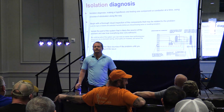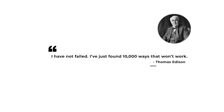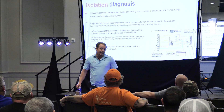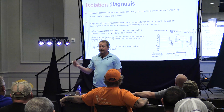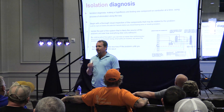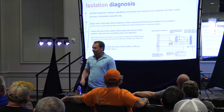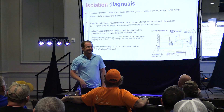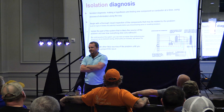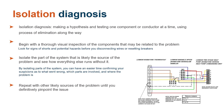The most over-quoted Thomas Edison quote: when he tried a thousand ways to make a light bulb and they said you failed a thousand times, he said no, I found a thousand things that don't make a light bulb. That is isolation troubleshooting. It would be ridiculous if he just kept trying the same thing over and over — which is coincidentally exactly what the new technician does with fuses. Pow, dang it, I got a bad one. Hey boss, I'm out of fuses. That's not the way to do it. You have to have a process of elimination. Process of elimination is another way of saying isolation diagnosis, but I mean a very specific thing electrically when I'm talking about this.